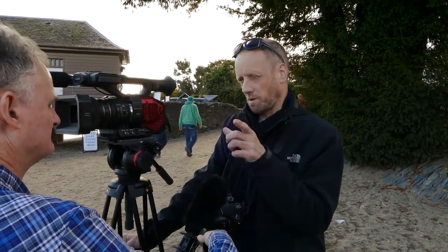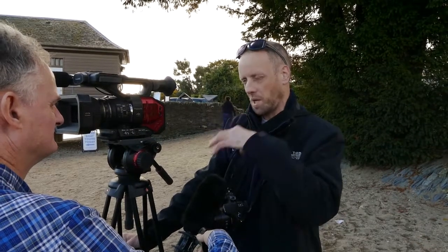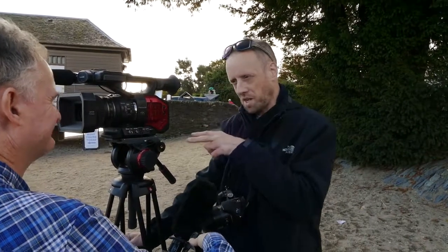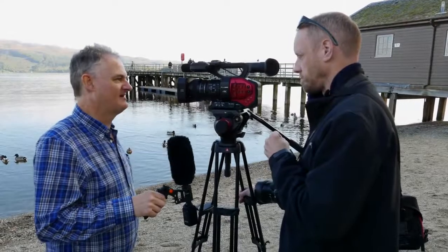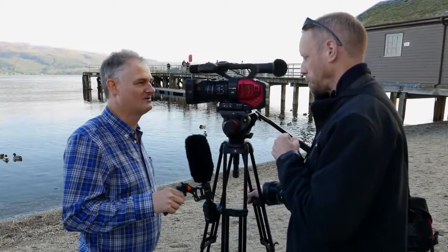Obviously, HD is still a big part of the business that we work in, and as much as we like having 4K now and the way that's going ahead, there's still a long way to go for HD. So this camera, if it didn't have 4K, it would still be a great HD camera. Plug-wise, SDI out is absolutely brilliant. If you want to work for satellite vans and things like that, do a bit of ENG, you've got to have that. The one thing that I do know from experience is that some cameras, although they've got the SDI out, don't give you SD, but this camera gives you SD all the way up to 4K.